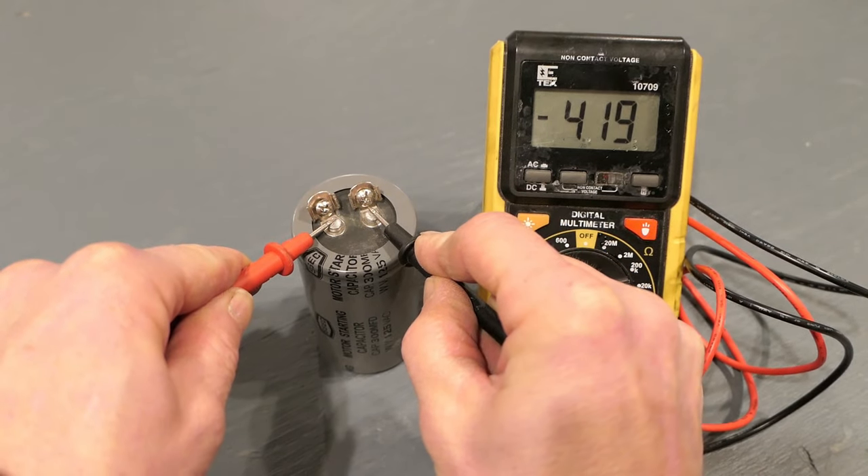Let me do one last follow-up. I still have the problem with this machine that I'm trying to fix. One thing I looked at is the electrical connections coming in, because if you have a poor connection — corrosion or a loose connection — you get a voltage drop, which could be a problem at startup. It might be enough to run the machine, but on startup you need everything you can get. I did find the power connections to the motor were a little bit loose. So far it seems to be working better now. The temperature in my shop is right on the borderline at about 60-61 degrees, so I'll have to see when it gets colder if the problem is truly solved. But right now, after tightening those connections, the problem seems to be solved.